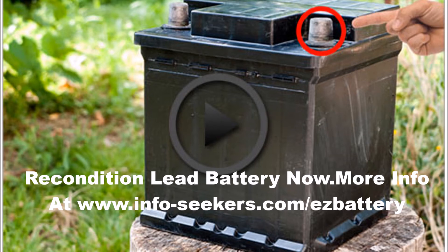Step 3: Remove all electrical connections to the battery. Step 4: Connect the battery to the charger. Step 5: Charge the battery until it has reached a normal full charge. Step 6: At this stage the charge is usually automatically terminated by the charger. Step 7: If your charger does not have an equalizing mode, restart the charger once the initial full charge has been reached. Restarting can be done by disconnecting AC power and reconnecting it. This process will extend the charge time for the battery by 1–3 hours.